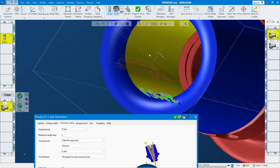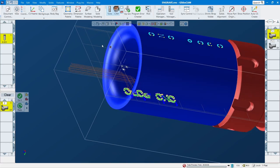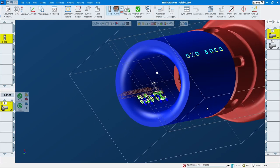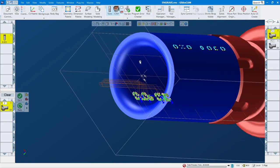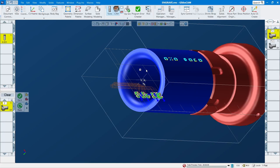At 75 degrees you can see it's much better and safer. You might have to try different values to find what degree works best for you. The important thing is this point — that's how you control the tool. If the text goes a little deeper, you may have to move this point in a little bit, as long as your tool holder doesn't touch the part.